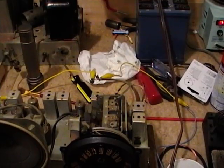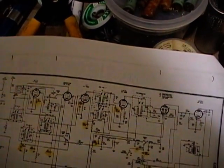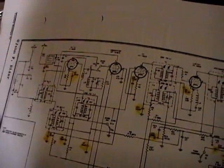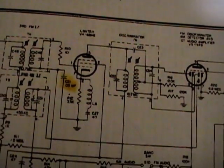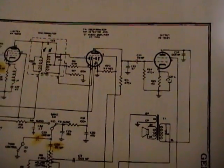It's curious because if you look at the schematic, so many components are shared by both AM and FM that for one to be working right and the other not seems weird. I've already replaced the 19T8, so I think the AM detector section is okay. But they share the same oscillator, mixer, converter, and IF stages — probably not a tube issue. It could very well be this coil, which is the 455 kHz IF transformer for the AM, as is that other one. I will check the tubes first and also see what's up with this bulb and check those IF cans.